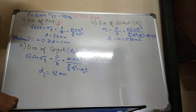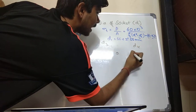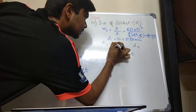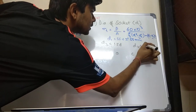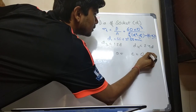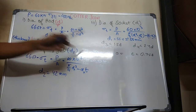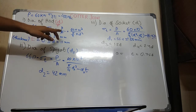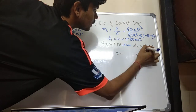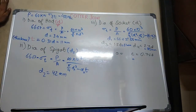Next is d3, d4, a and c. I'll explain what they are and how we are getting them. Directly, d3 is 1.5 times d, d4 is 2.4 times d, and a and c are equal, 0.75 times d. What is d3, d4? Don't panic, I will be explaining it to you. You know d, so the values will be 51 mm, 82 mm, and the value of a and c is 26 mm.